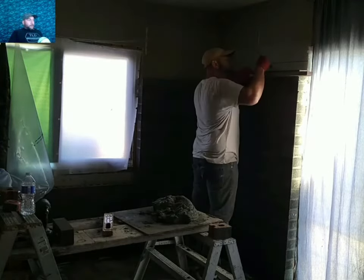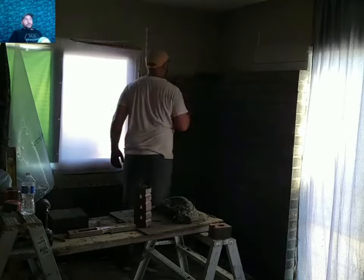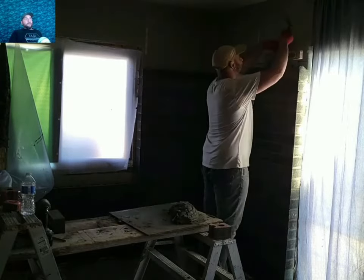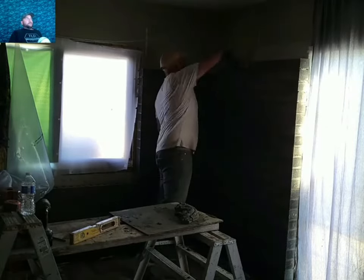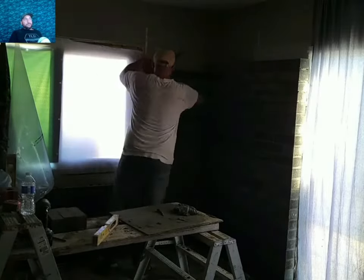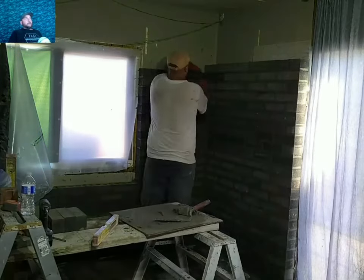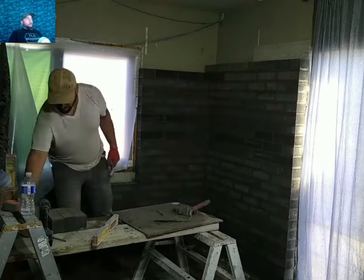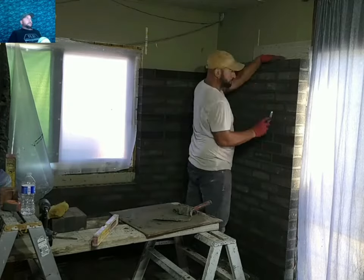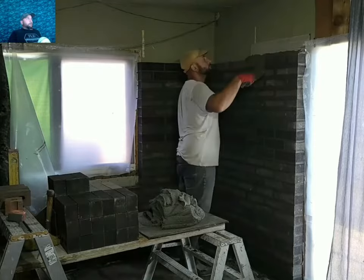I can use this tape measure — which gives you 10 different joint thicknesses — to gauge and hit those points exactly without making a cut. I got pretty lucky with my bond: it worked to fulls and halves on both sides of this background and even worked to full halves alongside the window. I had to do a little expanding and squeezing, which is very common, but I didn't actually end up having to make a cut.